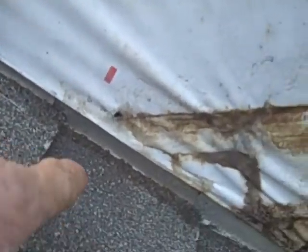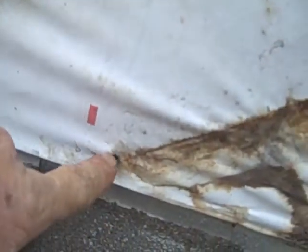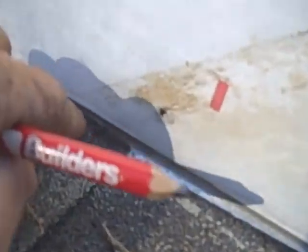This is the flashing, which runs up fairly high — all the way up from here to there. You don't want to put nails through your flashing an inch off the roof. You can see nail hole, nail hole, nail hole — nails literally an inch off the roof. Don't let them do it. Tell them to keep nails out of the flashing, or at least keep them up a couple inches. If they run it tight down to the roof, the water will wick and follow that nail hole right into your house, and you will end up with a leak.